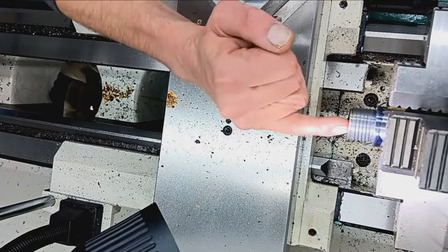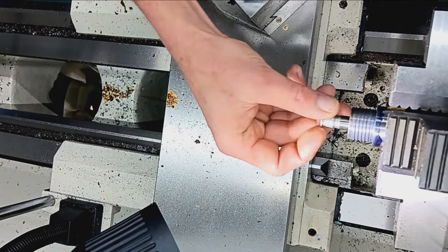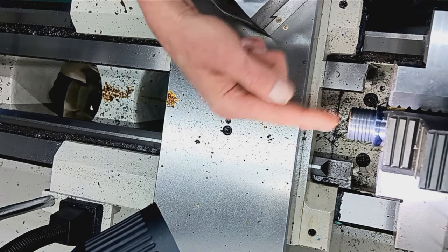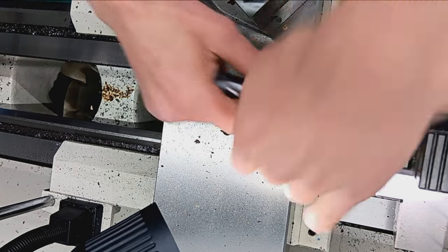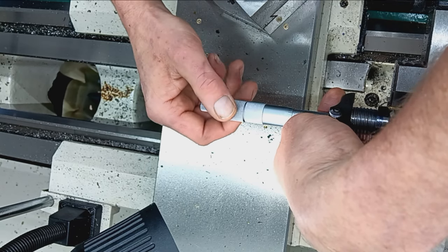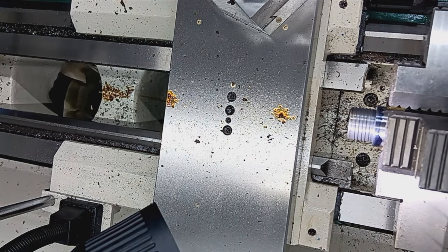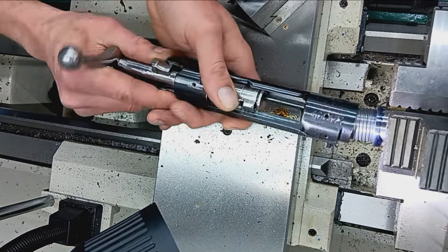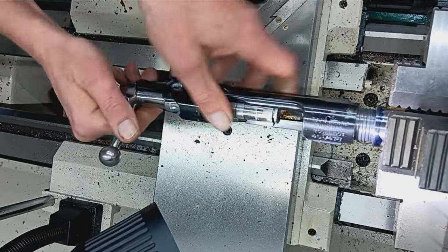Okay, we're almost to full depth on the reamer, so a go gauge. So this is going to be sub flush by 64 thousandths. And I just checked the action and it's still not closing, which is a good sign. Just get a measurement. 43 thousandths, so something like 20, 21, down.